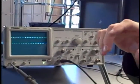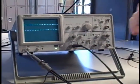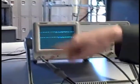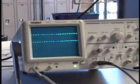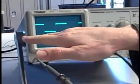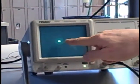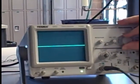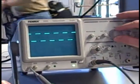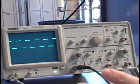It tends to freeze the rotating motion because your eyes only see this vibration dampener every time the light flashes. You see it once every other rotation in the same spot, and so you can see where that marker is. By the same token, we have a waveform that's going up and down continuously. What we want to do is make that appear frozen on the screen. So what the oscilloscope does is it takes the dot that we saw earlier that was drifting across the screen very slowly. Right there, we're taking this dot and we're speeding it up, and furthermore we're synchronizing that dot to the leading edge of our waveform so that when we attach it, it makes it look like the waveform is standing still. Even though the waveform is actually going up and down, it's like a strobe light that has caught the motion of that wave.